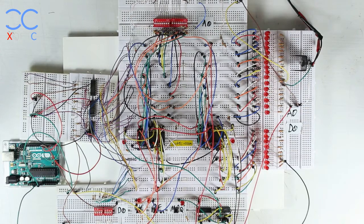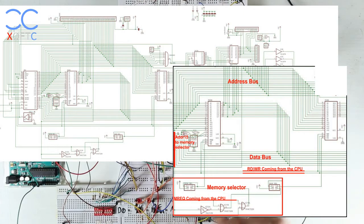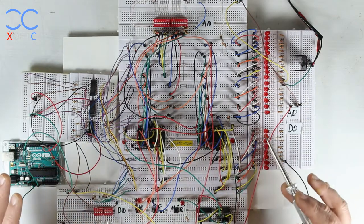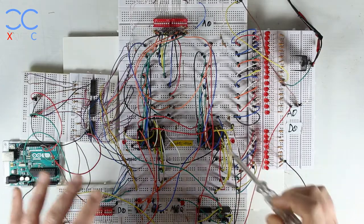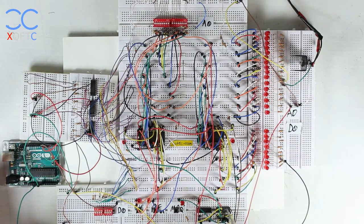There is a small logic circuit here — one inverter and two OR gates. I'm using one inverter, just like the original schematics. I'm going to put a picture in this section of the video to show which part was isolated from the circuit. It holds to the original design except for additions I had to make to get this to work as a standalone example.